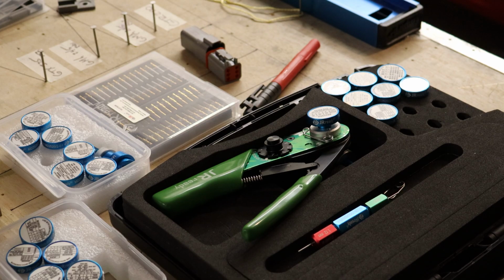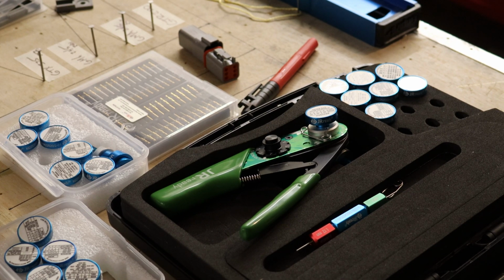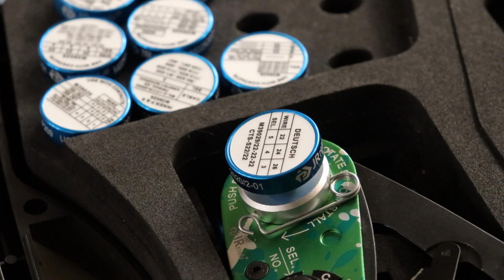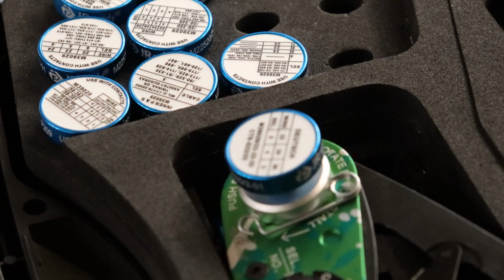Now the crimpers I'm working with here are the JR Ready crimpers. They're sort of a mid-level crimper when it comes to doing this sort of thing. On the low end, there's I think some $30 or $40 crimpers that you can get from an avionics supply. The JR Ready, the whole line's available on Amazon, and then of course at the top end there's the DMC crimpers that a lot of people use. Mixed with a copious amount of positioners that I've acquired, I should be able to use this not only for my Deutsch connectors, but any connector that'll be utilized when connecting the Garmin components.